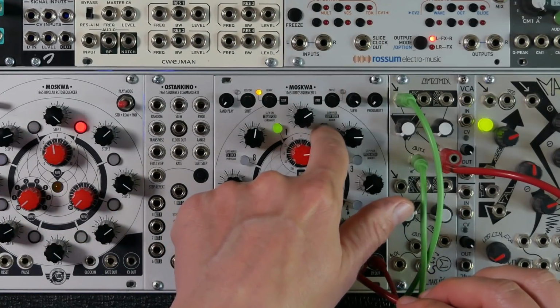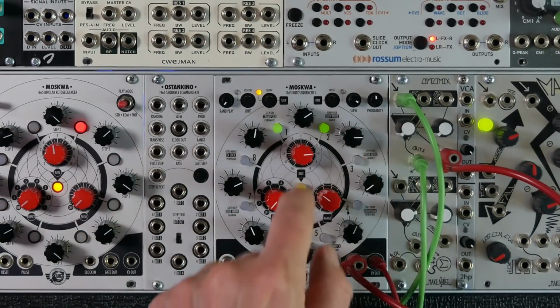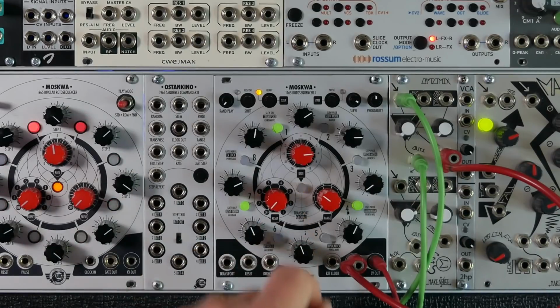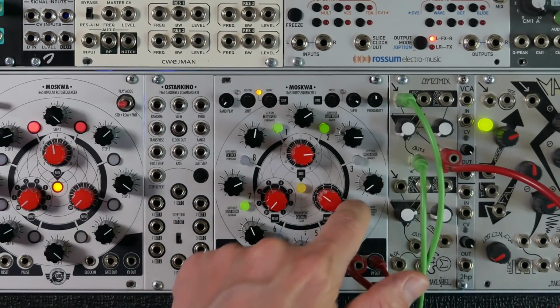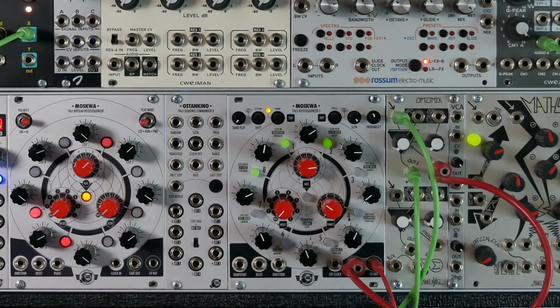And you can set the slew probability. So that independent from the probability function here, slew might be applied or not be applied. We can do that for other steps too. And probability is such a powerful feature to make interesting sequences. I really adore these features, and we're going to talk about a bit more when we go to the other modes. More options per step allow the ability to skip or to change the output signal to a trigger and not a gate, or half a gate, or to merge gates. So this way you can bind sequences together, which sounds rather nice, especially when combined with the slew.